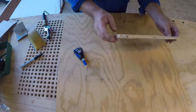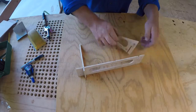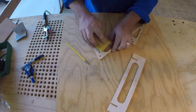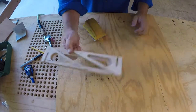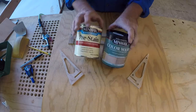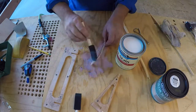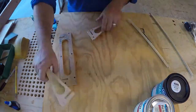I'm going to take it over to the edge sander and lop off the ears — the top ears of the sides — so that they sit flush. Then a quick sand and we're going to put a conditioner, a stain, and a polyurethane on it. A pre-stain conditioner basically neutralizes the wood and lets the actual stain sit evenly across the dark and light sides of the wood. Give it a good stir, give it a wash, let it dry and wipe it off — this is preparation for the stain so it lays across evenly.